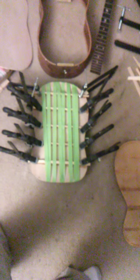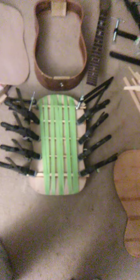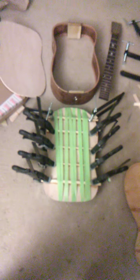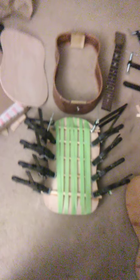We're letting the hide glue dry. I've got clamps on the outside, and you can use tape or ropes as clamps. I'm using a really strong scotch tape. Back in the old days, a lot of guitar factories building these by hand would use ropes, but you can also use tape, rubber bands — a lot of different things as clamps. On the outside I got clamps, and then down the middle I'm using my tape as a clamp.